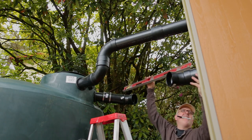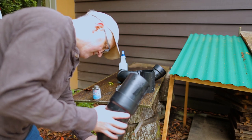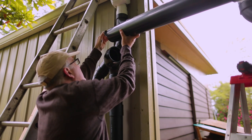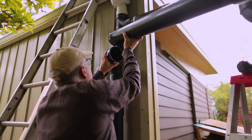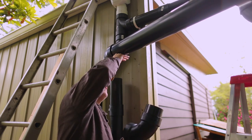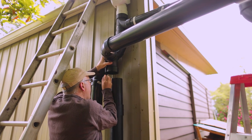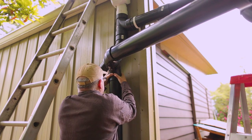The last thing to do was hook up the overflow — just a pipe from the overflow on the tank over to the old pipe that runs out into the yard. This doesn't seem like the best connection because the pipe cantilevers off to the side, and I'm a little worried that when it's got water in it the weight might not hold well. I'm hoping I never really have water running through it and can manage the tank level so it never completely fills up. But you don't want to make those your famous last words and then have a big water problem — so I do want to have it set up.